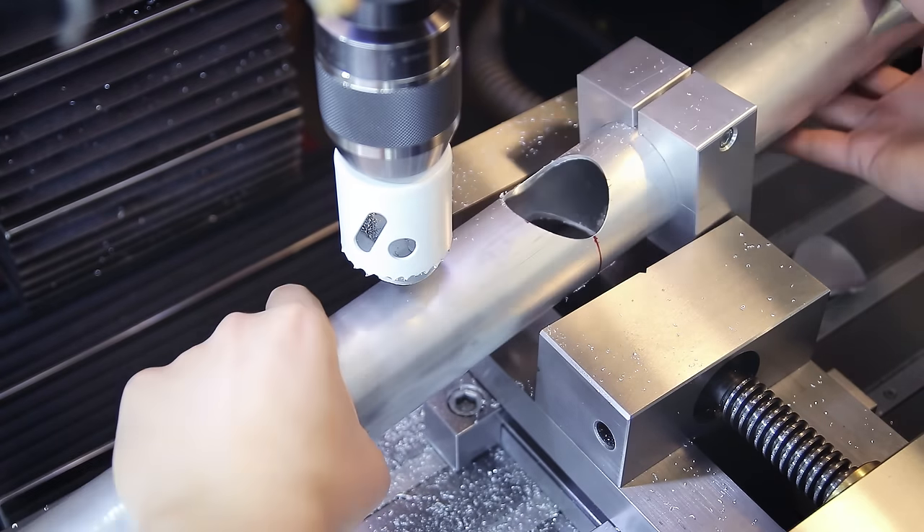With that little adjustment the main part of the frame is now finished, and we can start building the cage around it — which is quite tricky because there's a lot going on with all these different angles. First I'm cutting all the straight miters that make up the corners. Just like the downtube I'm relying on the tube locks to make sure all the cuts are lined up with each other later. Here's how I mark my cuts when going for precision: I put some marker in the rough area and then scribe a line on that, which makes it much less likely you'll mistake some random scratch for your scribe line — not that that's ever happened to me.